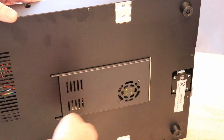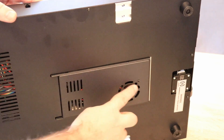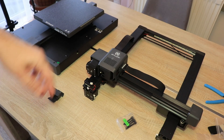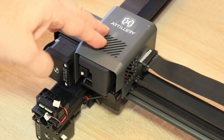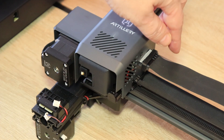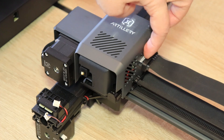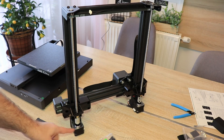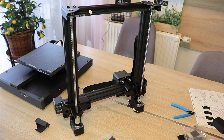This is the bottom side of the printer with the main 300W power supply unit, and it is not passive — I can see a fan, and for some reason they don't want us to open it. Now the Gen 3 extruder is a dual gear direct extruder, with the nozzle and an auto-leveling sensor. I have to check the cables because they look a little loose. On the backside we have dual Z-axis with two stepper motors, and on top the Z-axis are connected with a timing belt which keeps them synchronized even when the stepper motors are powered off. The tension is fine, and even if it isn't, it is very easy to add a tensioner since there is aluminum extrusion on top.